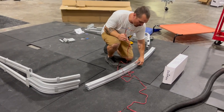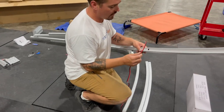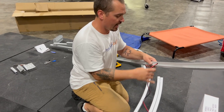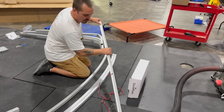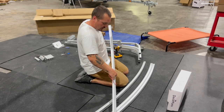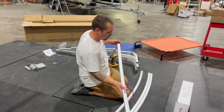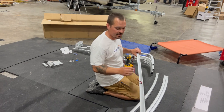I'm just going to take one bow and start by running my wire through the hole in the bottom. The bow is arched — we run through that hole in the bottom and out the side. Then I tie a soft overhand knot towards the end so I can pull all my slack out and not pull my wiring through, because I need this to tie into the anchor light.